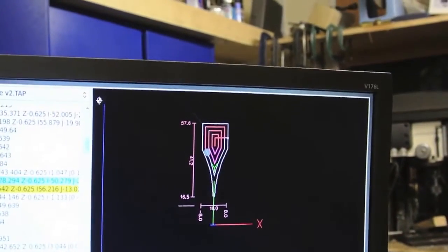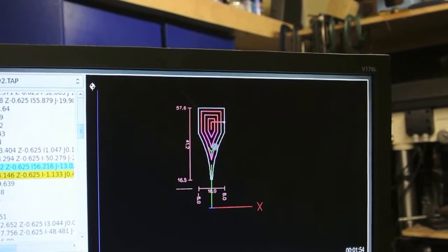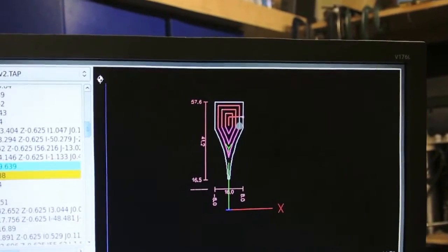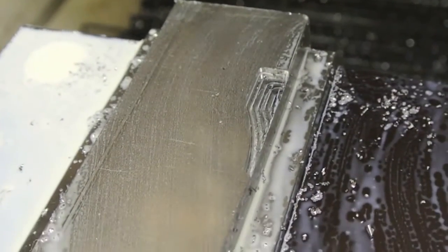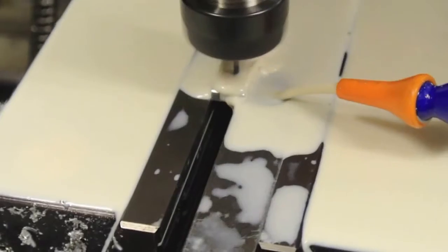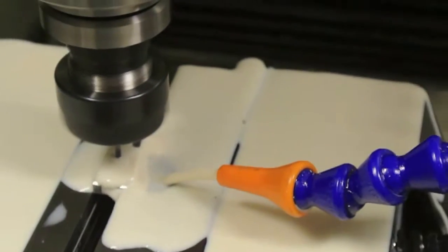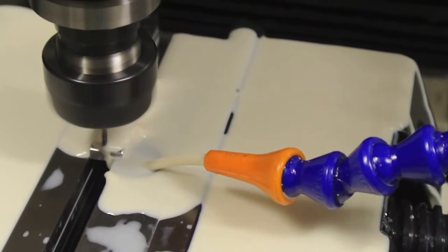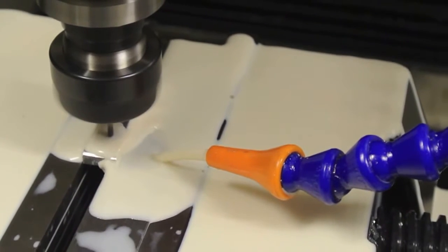On the screen here this looks quite good, and it's got about six passes to make. Well, there you see the cut part — I'll just wipe it out. I'll put the camera down and set it up so you can see how it works. So here you can see the slot being cut in the end of the work. I'd like to keep an eye on the tool holder — it should be okay to clear the tool, but I'll just keep an eye on it.